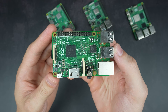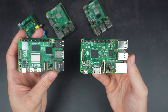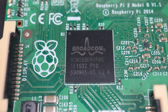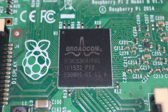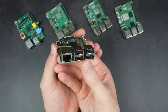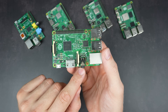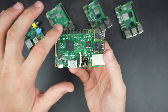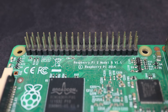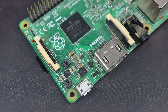The Raspberry Pi 2 was launched 3 years later in February 2015. It looked quite different to the original and more similar to the Pi's we know today. The BCM2836 SoC has 4 Cortex-A7 cores running at 900MHz and retained the same VideoCore GPU. RAM was bumped up to 1GB. It added another two USB 2.0 ports alongside the 100MB Ethernet port. The composite video port disappeared and analog video output was moved into the audio jack. GPIO pins were increased to 40 pins, which has followed the same layout since, helping maintain compatibility with hats and accessories. The SD card reader was changed to a micro SD card reader and power circuitry was bumped up to 800mA.